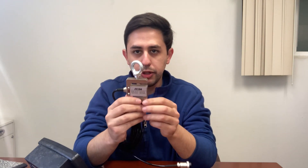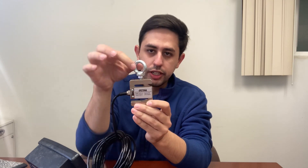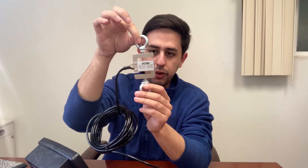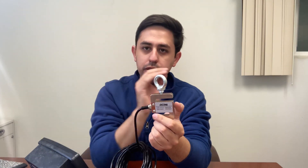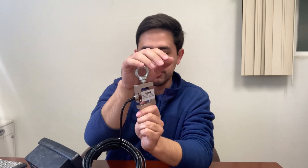The 901 — the most common thing we ship with it will be an S-beam load cell. These have a feature where they could be hung with a weight hanging off of it, or you can put a weight on top of it and be compressed. Either way, the 901 should handle it in positive or negative weight depending on whether it's compression or extension.